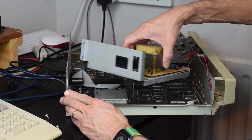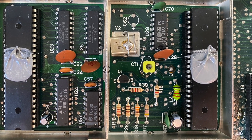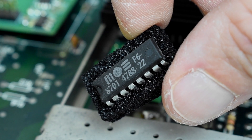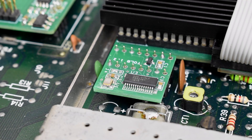So I opened the case up, moved the power supply out of the way and had a look around the video circuitry area near the VIC-2E chip. The first thing I tried was changing the MOS 8701 clock generator for the VIC-2E for a modern TOLB module — TOLB being an imaginative acronym for 'the other little board' — in case it was at fault. This was easy to try and reversible: I just had to desolder the chip, put in a socket, and plug in the TOLB. But there was no difference — no better, no worse.